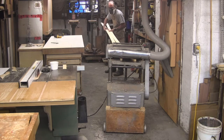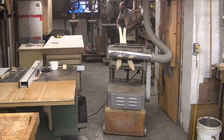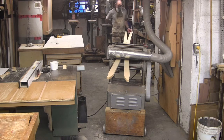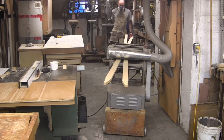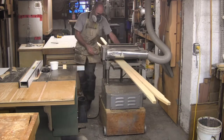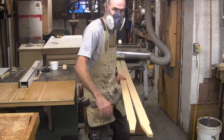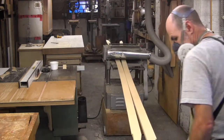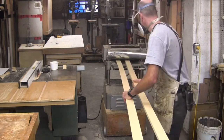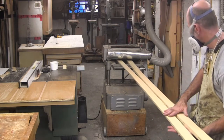From here on in, I'll be using my traditional methodology to recreate the rest of the boat. I'm not going to be making molds or anything that replicates the drawings — just taking basic dimensions off those drawings to replicate the depth of the cockpit, for instance. I'll probably try and replicate the profile of the bow and stern, but it's not the same as strip construction. There will be no molds beyond some spreaders with a specific angle cut into the ends.